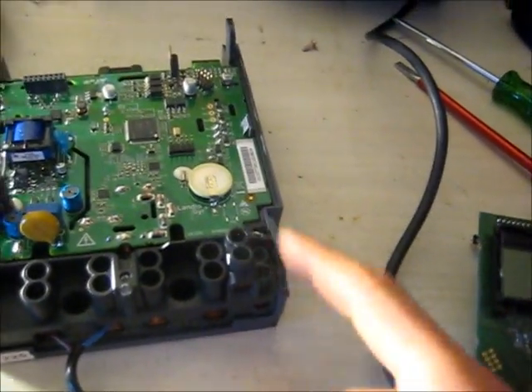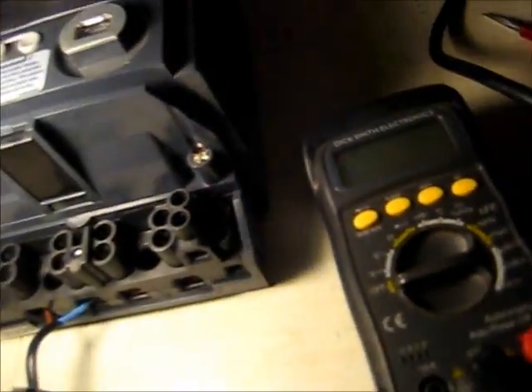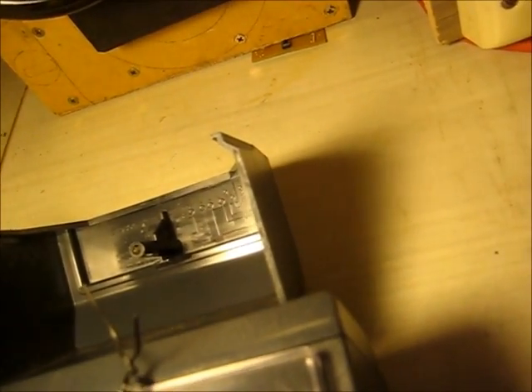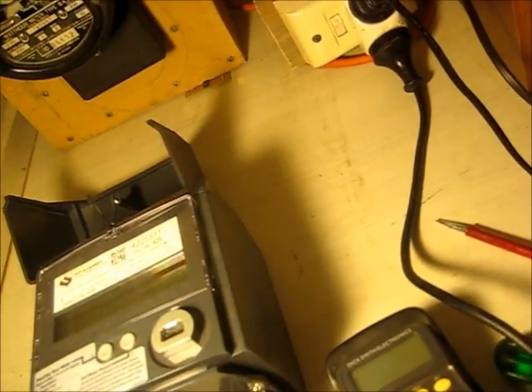Another thing I just noticed: they used to have an LT — load trigger — and that goes to the other relay, the little 40-amp one I showed before. I'm going to test what voltage comes out of this trigger. Obviously you're going to get 240 volts — let's go. I'll just do a check anyway. It's got L1 and T, which is a trigger, for your 40-amp ones. So you need some sort of 240-volt trigger. I'm assuming it goes to something that runs on a certain voltage to trigger a relay — although that might be for an inverter when you're feeding power back to the grid.